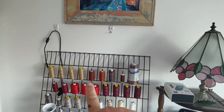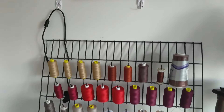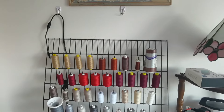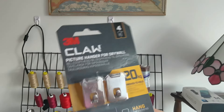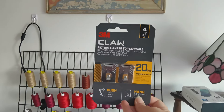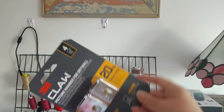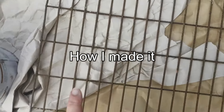I need to put this up — I had those little hooks but they're not strong enough. This shelf is about six or seven kilos, so I'm going to use these drywall claws: you hammer them into the wall, and each claw carries about seven kilos. There are no studs where I want to hang it, so putting up three or four might be overkill but it should hold.